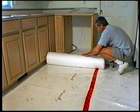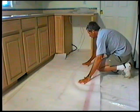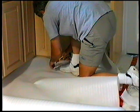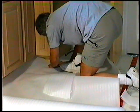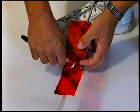All flooring installations require foam underlay. If you're working on a floor over a crawl space or on a concrete floor, you'll also require a poly vapor barrier as described earlier. Make sure that you run the foam underlay in the same direction as the laminate panels. Underlay should be butted side by side with no overlap, and tape seams together.